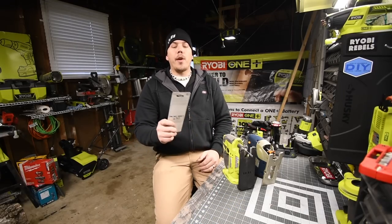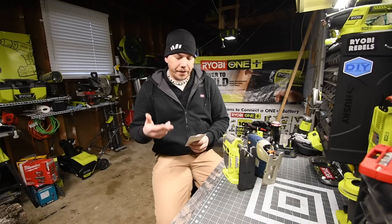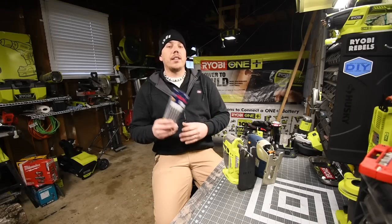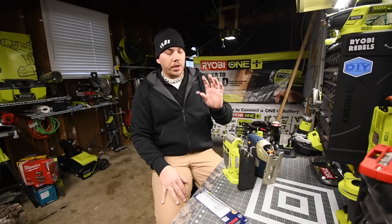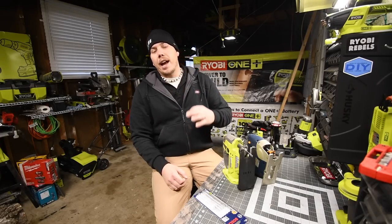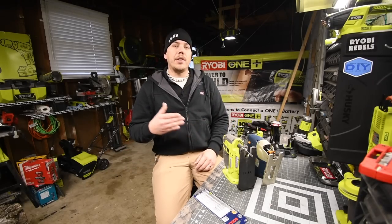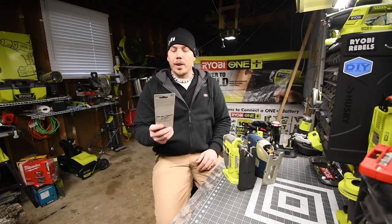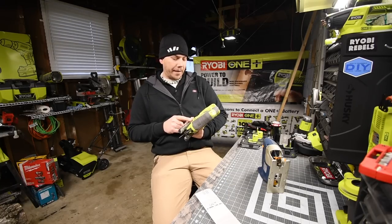And I just picked up brand new Bosch blades. These are T-Shank, fits all, T308B. Now this is a wood blade. Most of them are universal, and so just the blade determines what you're cutting, you know, how fine it is and how sharp, how many teeth it has on it. That's the main difference, what blade you need for a certain situation. In this situation, we just need generic blades, so I got this 5-pack for $10. Model number for this is P524.